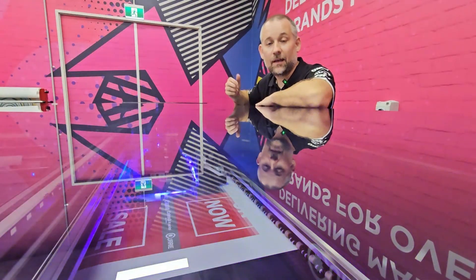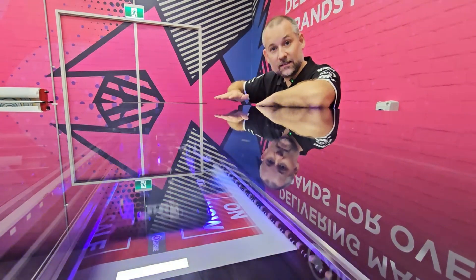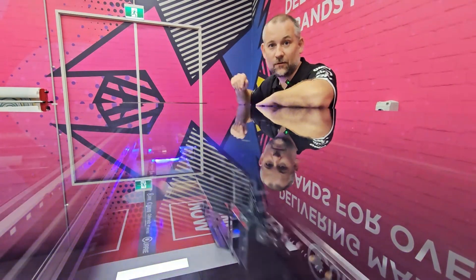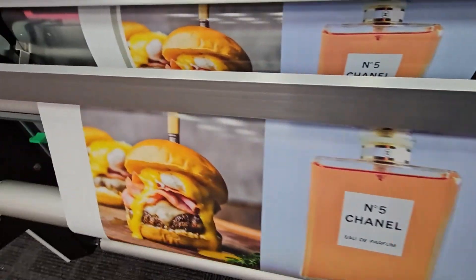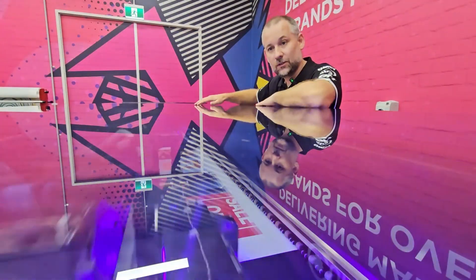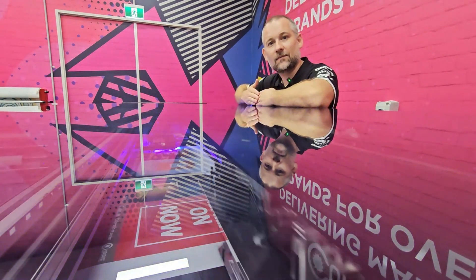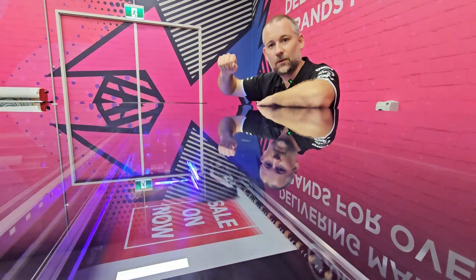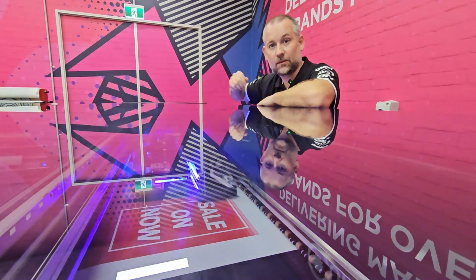So now we're printing in gloss mode. Gloss is basically a smooth finish, like this lid — incredibly smooth with a great gloss effect. We're doing exactly the same thing with the ink. What we've done is separated the print bridge from the curing bridge, and what that means is it gives the ink time from printing to curing for the ink droplet to hit the substrate, flatten out, become smooth and glossy.